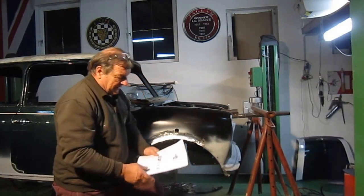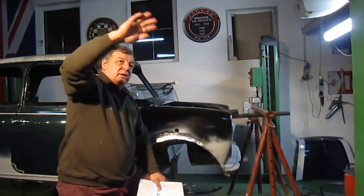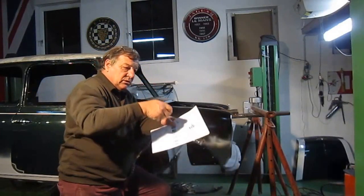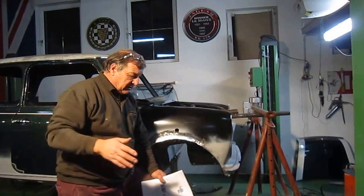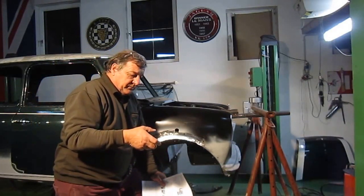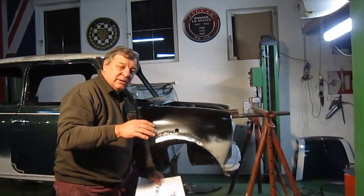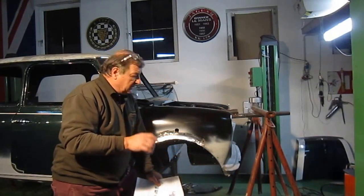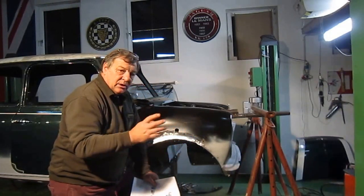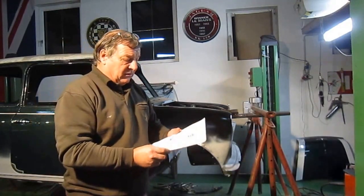So I'm going to treat myself to the English wheel and my wife's treating me to the welder. This one's really nice — it's got an overhead kind of gantry on it with a balance spring, so as you're holding the machine you can balance it, or balance the cables, because it's pneumatic — it has pneumatic, air-operated jaws. The nice thing about it is you can get extensions for it. Because the problem with the basic ones is the arms are too short — for a mini on the edges or the sills, no problem, but when you want to go internally, it is a problem. So this one's got different extensions, and this is the one I'm going to go for.